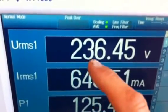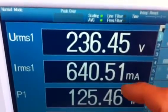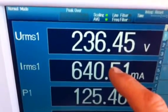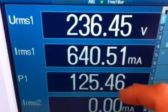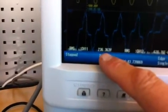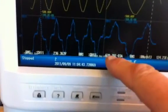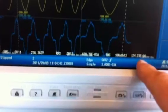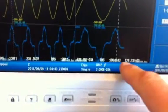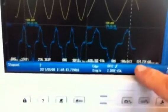The reference power meter shows 236.45 volts and 640.51 milliamps on average over the same 10-second period, with P1 at 125.46 watts average power. The DL850 shows 236.36 volts — very, very close. The current is a little bit off at 638.76 here versus 640 in the power meter. The calculated power is 125.46 watts in the power meter and 124.23 watts here, giving around 1% accuracy on power.